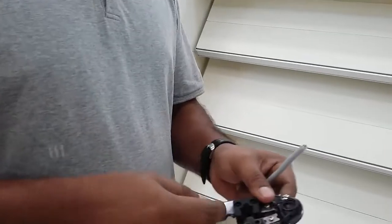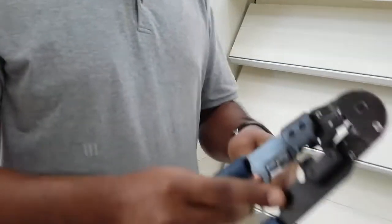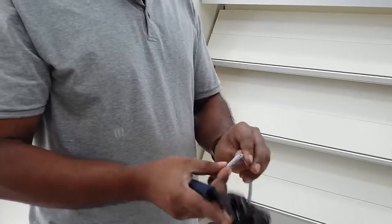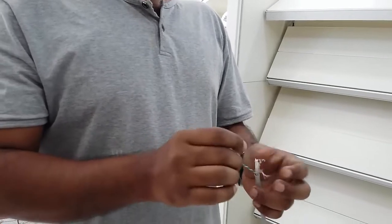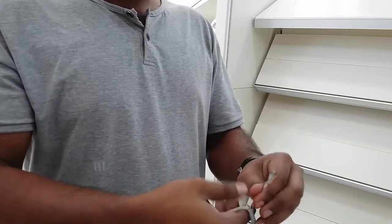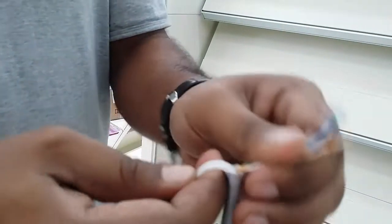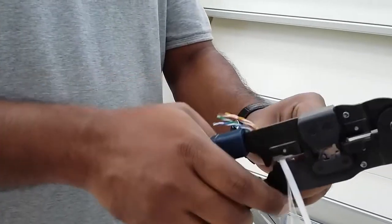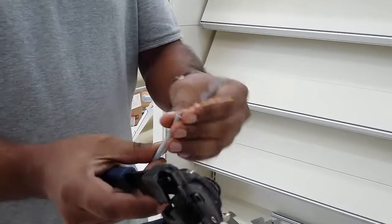So we need to cut the cable. Here you can see this grip — we can put the cable inside and go one round, then you can just break it like this and the cable will cut. You need to take care, so let's remove it. After that you need to cut this outer jacket from here, just remove it very carefully because this is sharp. When you drag it like this it may hurt you, so just carefully remove it. Then take your crimp tool, put it here and carefully cut — no need to cut the internal cable, that's all.